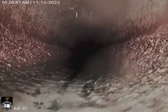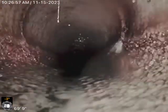It should be getting close to the city line, I think. It should be coming up on it. Another joint right here. Looks like we have a little tiny root tail right here at the top of the pipe trying to stick through. That would be out in the street, so that's kind of strange. I mean, 60 feet — we're beyond the property line for this house.